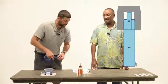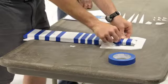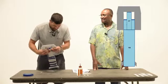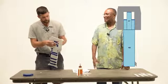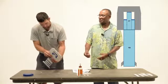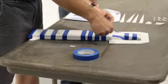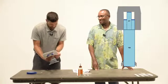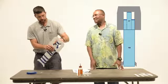How much does weight play a role in it? It does play a role. Over the many years I've been doing this, I've noticed that each boat is different, even though it's a kit. Some boats, it works out the lighter the better. Some boats, actually, the heavier the better. So it just depends, and we learned that in the testing process. We can put weights — I use fishing weights — and we actually place those in certain portions or parts of the boat to give it balance. It goes back to critical thinking. Once a student understands the basics of aerodynamics and hydrodynamics and lift and thrust, they can look at their boat and have a pretty good idea of where they need to put weight.